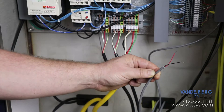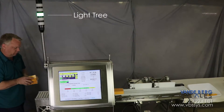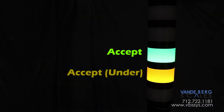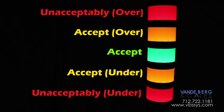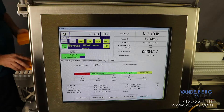The customer adjusts the cutting machine accordingly. In addition, a light tree provides visual indication of weight status for each cheese block: green for accept, yellow for acceptable but slightly underweight or overweight, and red for unacceptably overweight or underweight. All of these functions are controlled by our SDS touchscreen controller.